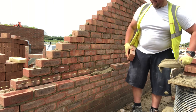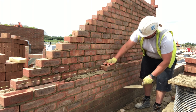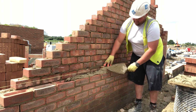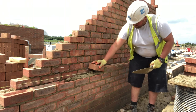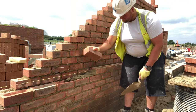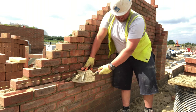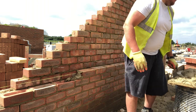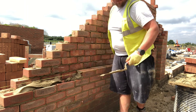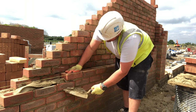I've been getting my tub pretty wet recently with this hot weather, and it's muggy as well in this area — your gobbo just dies instantly as it goes on the board. I've been getting it wet, and I've been leaving the bricks uncovered now. I've found that even if the bricks look wet, they're still dry. Even if I leave them uncovered it makes them a lot easier to lay. I'm definitely going to leave every pack uncovered — the bricks can get wet quick here, but as long as the weather stays hot continuously, these bricks should be good to leave uncovered.